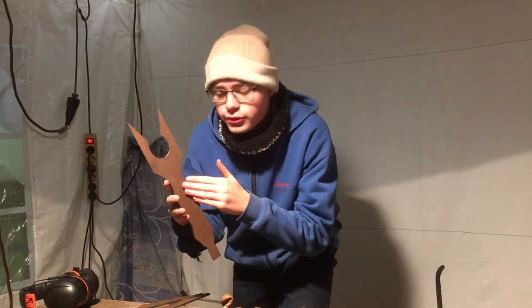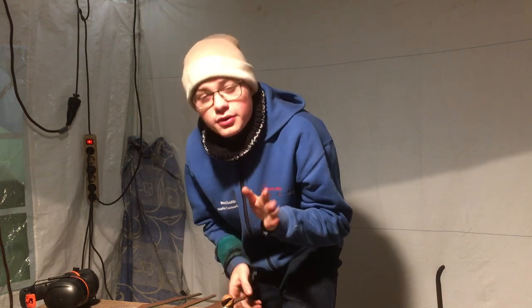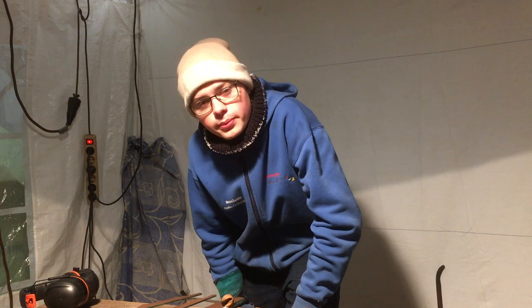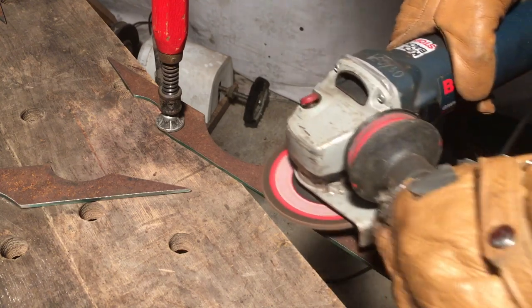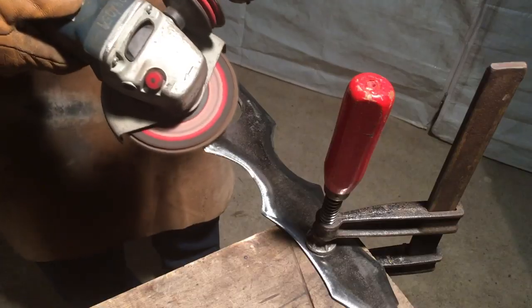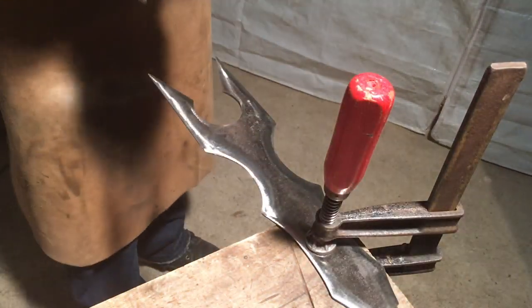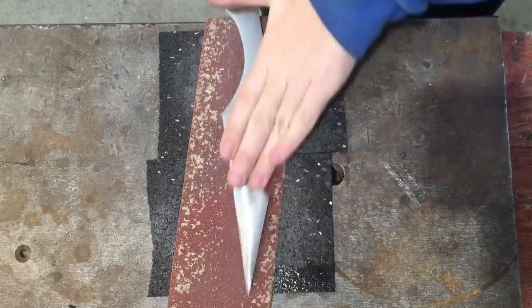As you just saw, I've filed the outline to near completion, and now I'm going to have to do the bevel on the piece. I'm just going to freehand it. It's going to be a rounded bevel — it won't make a knife edge; I'm going to stop a little short and round it all over so it's nice and smooth. Should be fairly quick work, and then I can move on from there. Let's do it.